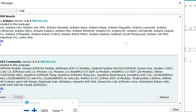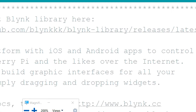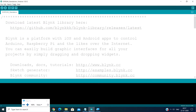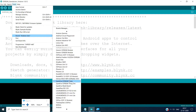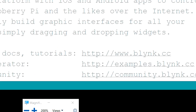There is a search box — type ESP and you will find the ESP8266 package. Install the ESP8266 board. When you install it, the board list will update automatically. Now you can install the NodeMCU 1.0 board by going to Tools > Board and selecting it.